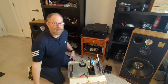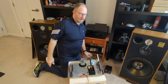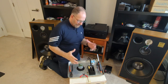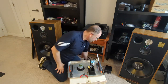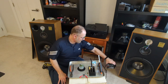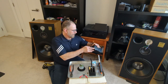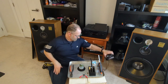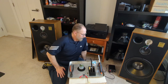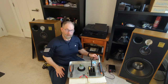All right, you're not gonna see me coming in and out of the frame. My head will get cut off, but this was the best angle I could give you. I'll try to work on this tweeter right here. Hopefully you can see what I'm doing. Right now I've got the soldering iron heating up. This one I run close to 800. It seems like with these thicker wires, it works better at 800 for me. I've also got my hot glue gun plugged in, ready to go.